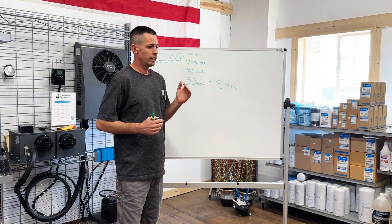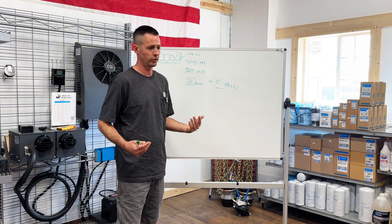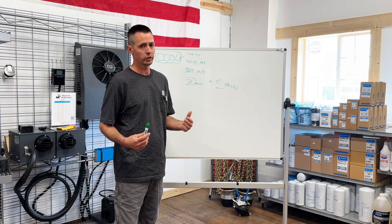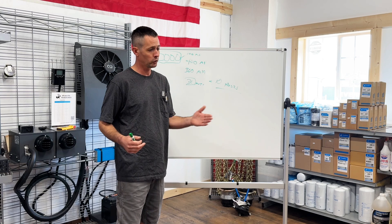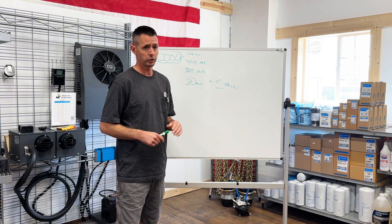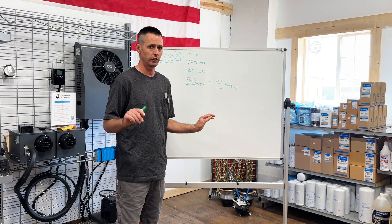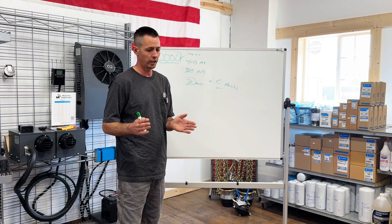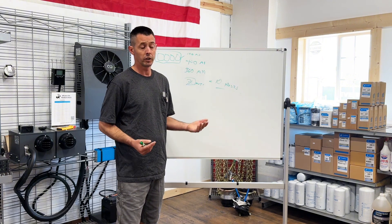This is all important because I see a lot of companies out there that aren't being very truthful about their runtimes. You spend good money on these systems and you get out there and you're only getting three or four hours out of a $9,000–$10,000 system — you're going to be upset. A lot of competitors just say 'up to 20 hours,' which is a huge spectrum. On the low side that might only be three or four hours. You really need to look at the amp hour capacity of the system and the average amperage draw — they're going to give you the lowest end of the spectrum when calculating those times.